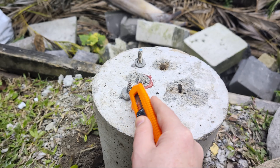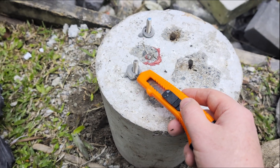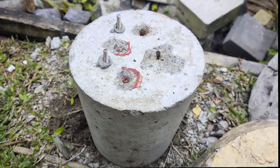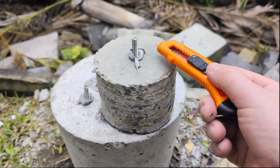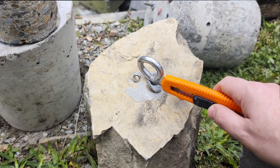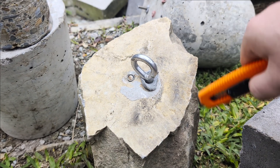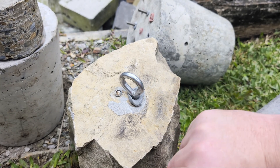For the polyester, it's nice and hardened — it's been about a week since I installed these. These are the same little studs as my previous video, so we'll be able to compare these directly to that big data set. I also got one in this little core sample. Then I've got one in a very hard rock — this is trachyte — where I'd had a polyester bolt previously and it got over 50 kilonewtons.